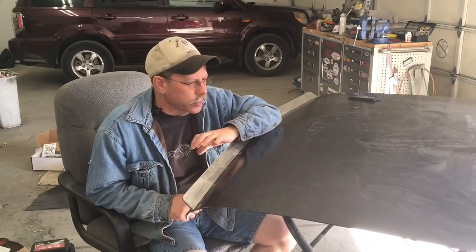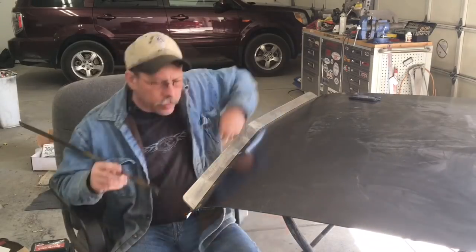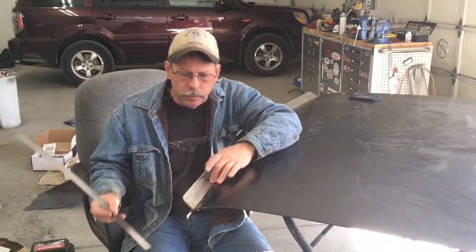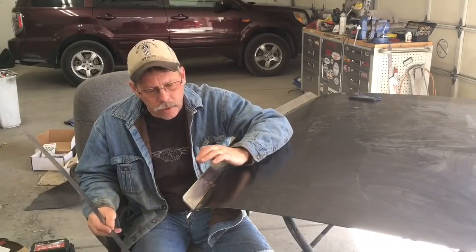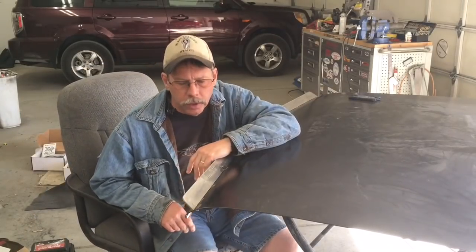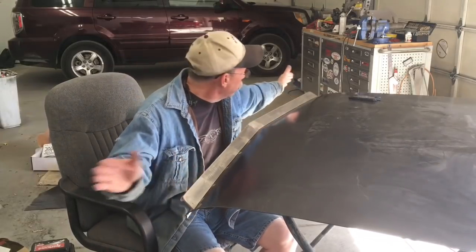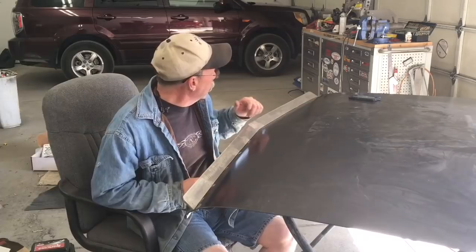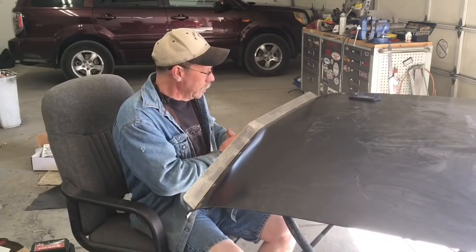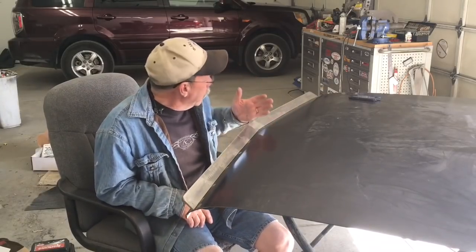So there's a couple different steps after I got the idea of how big I wanted it. I basically started with a 2-inch tall by a 1/4 inch flat bar, just flat bar steel. And you'll see that I started out with it full length without the bend in it, and figured out pretty quickly that this bend was going to require pie cutting the steel. So I ended up cutting it in half.